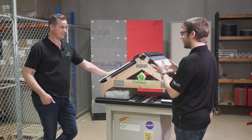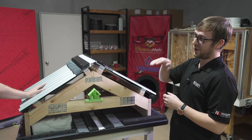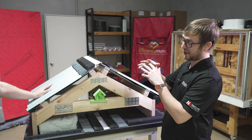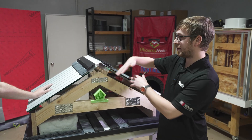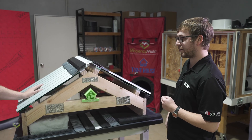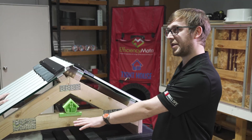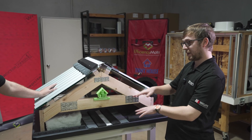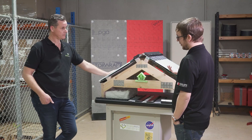Instead of using something with an impermeable foil, we'd recommend using a vapour permeable membrane which doesn't stop vapour from escaping. You have a drainage batten which gives some detachment and a little bit of a thermal break, so you don't have that major temperature gradient coming all the way through. With the insulation moved down onto the ceiling, you still get the same overall benefit to the occupied area in terms of heat loss.